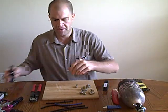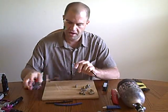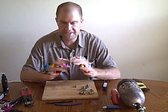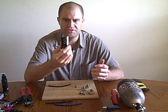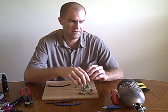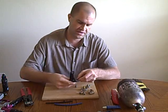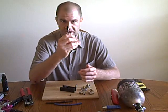Now let's talk about MacroLine. One of the worst things you can do is cut it with wire cutters. MacroLine, in order to seal properly, has to stay as perfectly round as possible. The best thing I've ever found are these tubing cutters, made by Grainger. You can find these at any pneumatic store — I believe they run about $6 to $10. If you have a Grainger or SMC store near you, pick up these tubing cutters. They make perfect 90-degree cuts in MacroLine every single time, and the seal you get will last forever.